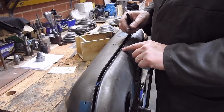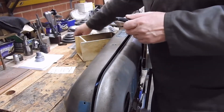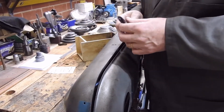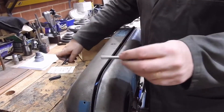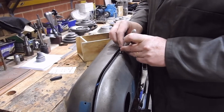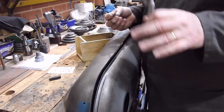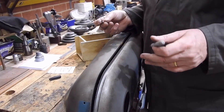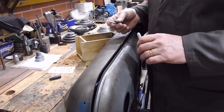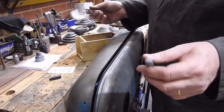Here's my guard. What I'm going to do is cut along here and put one of these strips in here. To mark that out I'm going to use a little bit of this - it's actually 3/16th I think, but it's close enough to 5mm key steel - and just use that as basically a marking gauge to put a line around there that I can cut to. It doesn't have to be beautifully uniform, just good enough that I can run an angle grinder around there and get a reasonably uniform cut, because what I'll then do is tack in my bit of strip and everything will be wonderful.